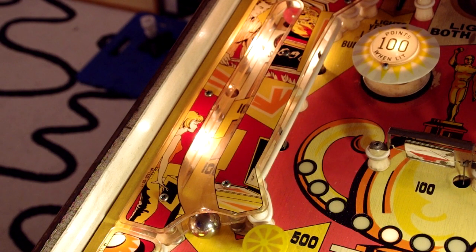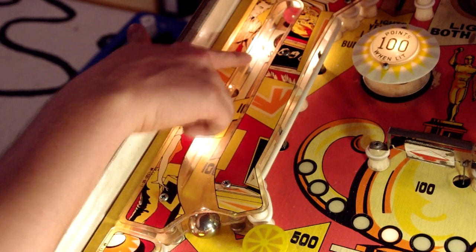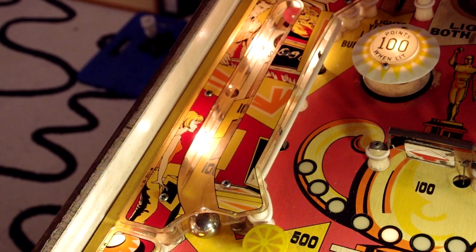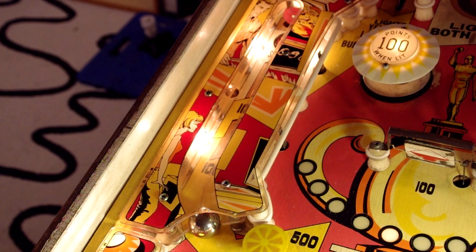Right next to the mushroom bumper on this machine is what's called a captive ball. A captive ball is simply another pinball being held in place by certain playfield elements, and you can hit it directly with the other ball. The captive ball in this machine will travel up and score 1000 points, or if this is lit will also advance bonus for each of the two rollovers. If special is lit at the top and you hit the target at the very back you'll get a special. There's really nothing special about a captive ball target on the underside of the playfield since it uses standard rollover switches and a stand-up target.